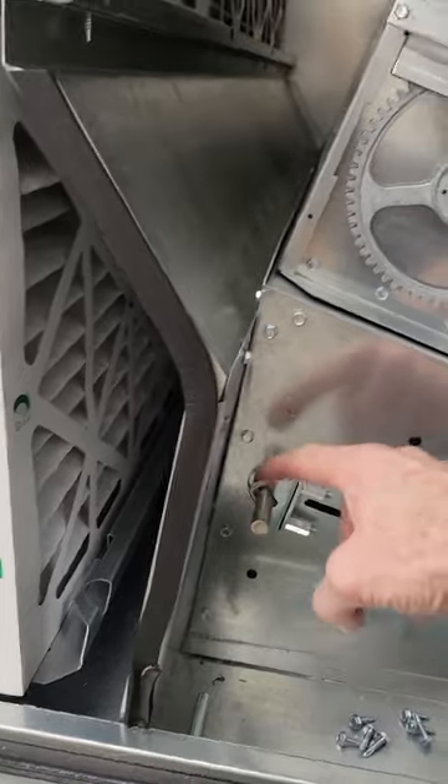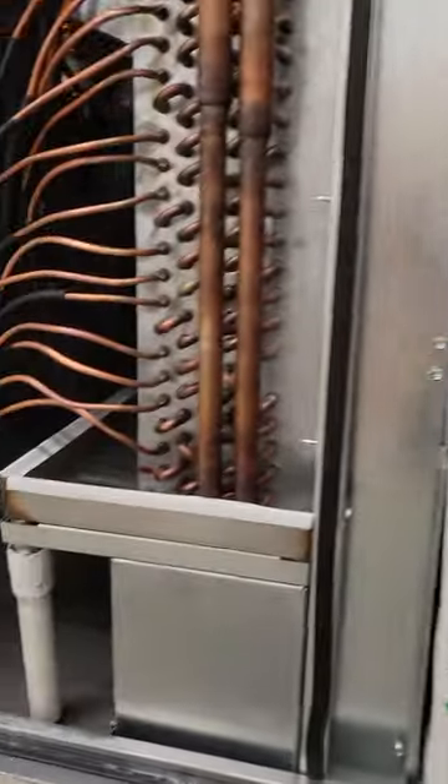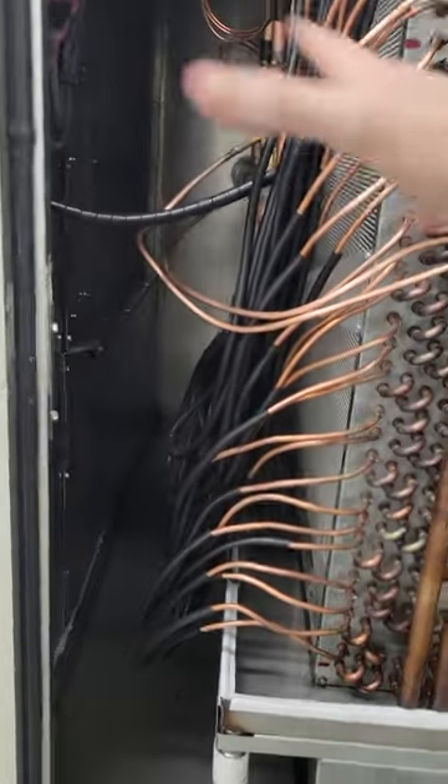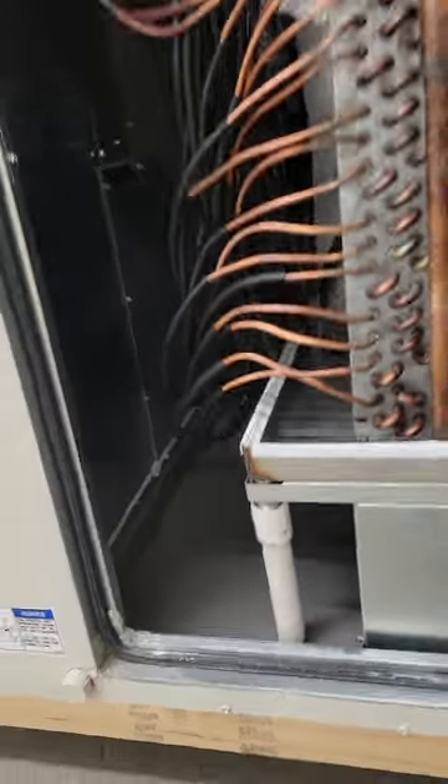This is it here. You could put a damper actuator on there, but we don't need to do that for our purposes at Costco. So all we're doing with this thing is we're bypassing the evaporator coil. This is your evaporator — the thing that cools all the air coming into your store. These dampers send the air through the coil, it cools off — that's traditional cooling. But on this unit, there's an opening down here, just a bypass, an area where air can come up. Right down there you'd be looking down on the sales floor in a Costco. There are some air filters there. So the air is coming up from the space, going through this damper, and underneath the cooling coil — so it's not being cooled at all. It's just completely bypassed.